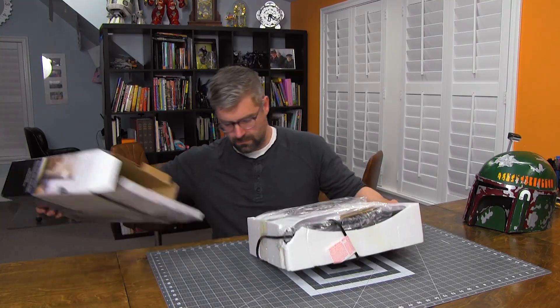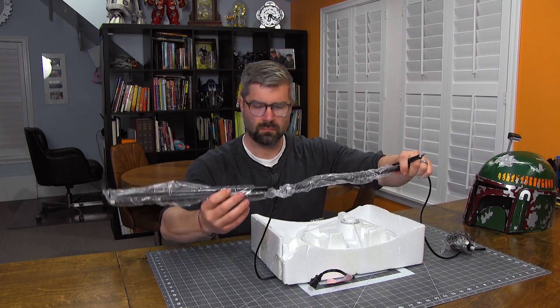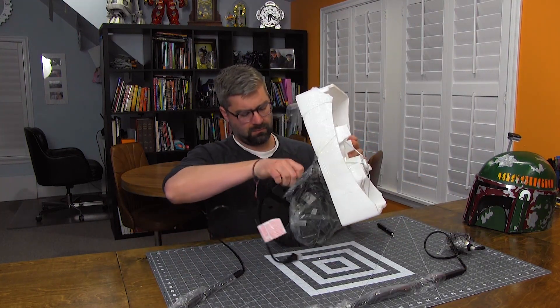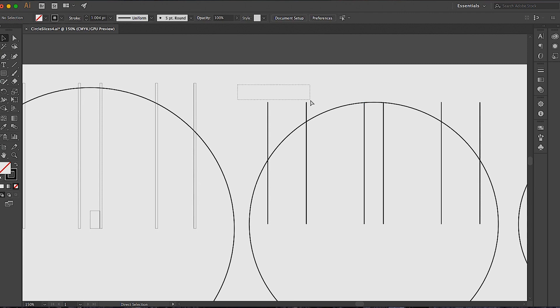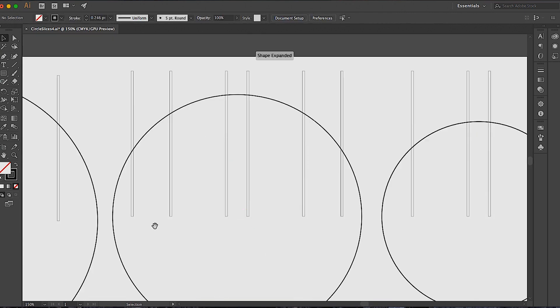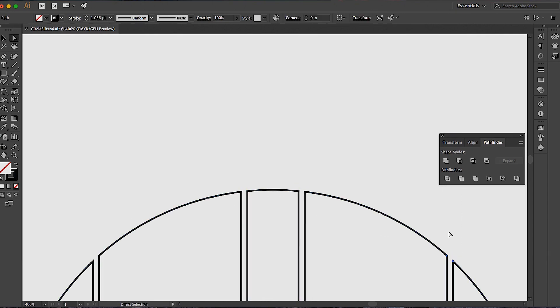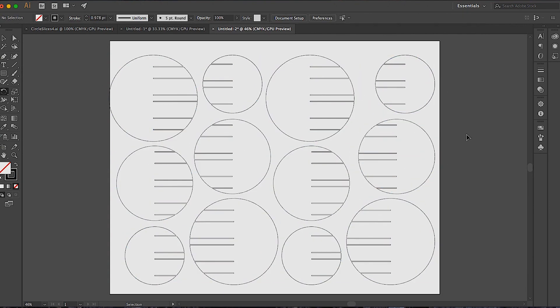By this time I'd found an inexpensive floor lamp that we would use parts of for the base of the stand, and had taken measurements of the pole to make sure there was enough space in the middle of the slice form for it to fit. I had some sheets of eighth-inch acrylic and really like how smooth the finish it can have with little to no sanding. So I took the final design and altered it to factor in the thickness of the acrylic so that the pieces would slide into each other smoothly during assembly. The goal was to get close to a friction fit, but I figured I'd be using some glue to keep it all together.